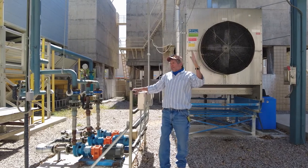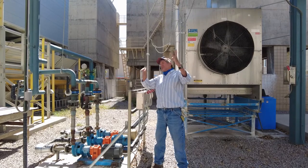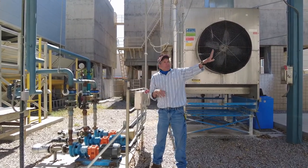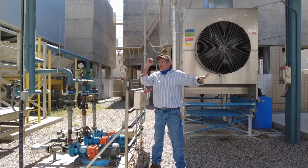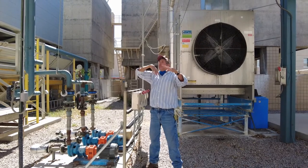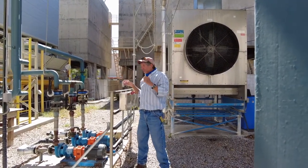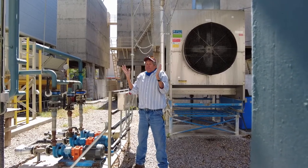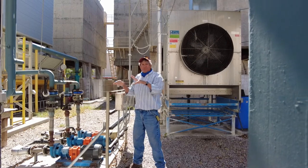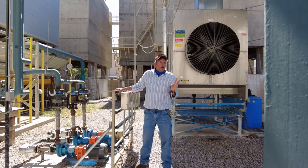1.5 megawatts could go through that switch. Our turbine puts out about 4.5. Main campus in the summer takes about 3. We put about 1 to 1.5. Well, from about 0.5 megawatt, 1 megawatt through that switch going down the Tortuga. And if we do have a problem, then we have three 200-amp fuses, about a megawatt and a half, in there, and they should blow.